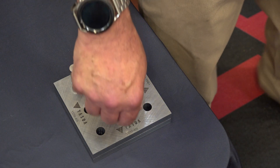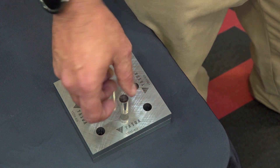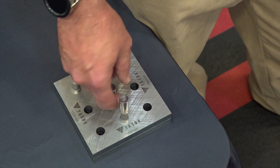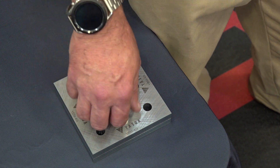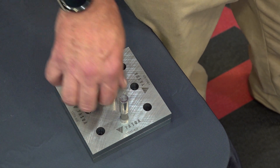Ben, this is a cool project, and there's not a whole lot of machines — if any — that can actually do what you're doing here today. So what we did is we took this plate and we drilled the holes, roughed them out, and then roughed out with an end mill, circular interpolating them, and then finished them also circular interpolating with the same end mill. Just did one spring pass and came out with the precision part, basically showing you that it can end mill a round hole.